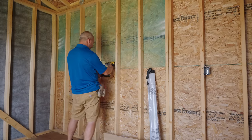So, for instance, when you get to the point where you're gonna trench, maybe next year, maybe 10 years from now, you can do the trench, you can run your feed wire through, and on the outside, you can bring it up through the pipe, put it through an elbow, put it right through this box, take the cover up, bring it right through the box onto the floor, and then you can add all your glue joints, do all that connection, give it one more tug, and then you can feed it up through here, through your conduit, right into your panel. This gives you access as a junction box for the feeding of that line, which is why we're using it.